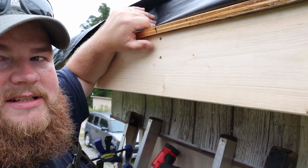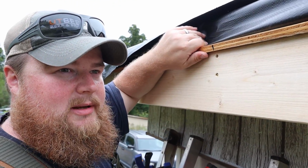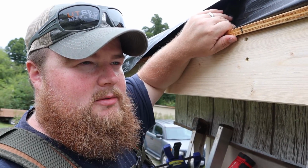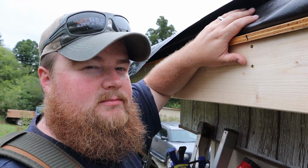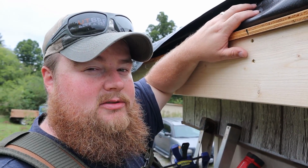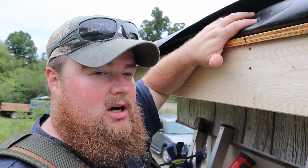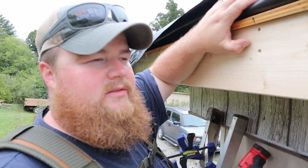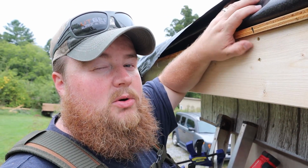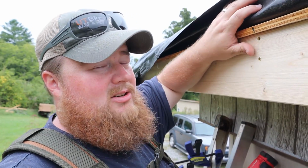Told you, looks good, doesn't it? Now this reveal, this little lip, I will come back and probably trim. Yes, probably will do that. Yeah, I will. I've got to work out some inconsistencies down on this end of the roof. No, the other end of the roof where I started off. So I've framed up the soffits or eaves, whatever this is, to be about 1/4 inch under length. And it turned out really good.